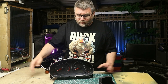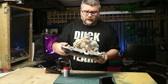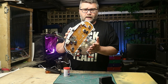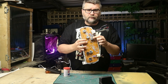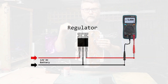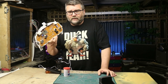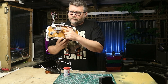If you did make a random purchase of a dashboard, you'll get it like this. Hopefully you've got the plug in it — I've just chopped it off at the loom so you can wire into those rather than trying to wire into a socket, which is a bit of a nightmare. The first thing you need to do is find out how the power gets into it. Almost certainly they'll have a voltage regulator on it, which converts the voltage from a high voltage down to one that's going to work inside the unit. Running 12-volt motors and LEDs doesn't make much sense, so I converted it all down to five volts.